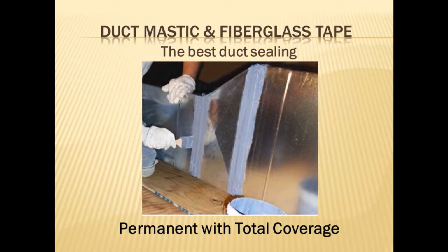But when you don't have that, then you can get into taking the aluminum, even in small pieces, and putting it together. And we never use the mastic for an access hatch because it's too hard to open. It's gummy, it stays sort of hard to get to, so don't do it. So we'll keep this in the toolbox, and we'll use this for anything that we might want to open later. And anything that's permanent, hidden away in a corner, closed into a wall, is all done with mastic. And you're getting air sealing.